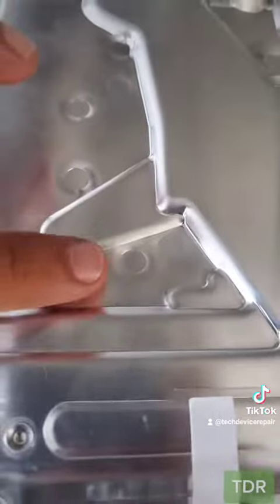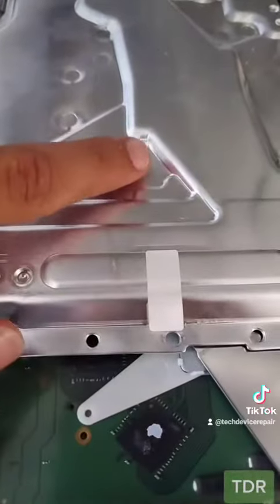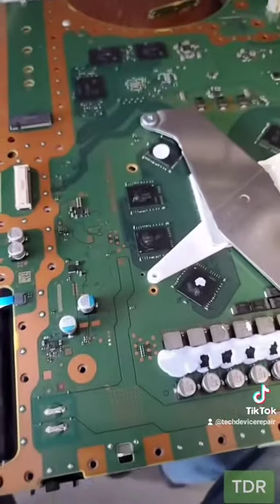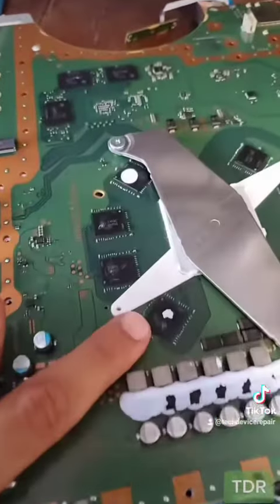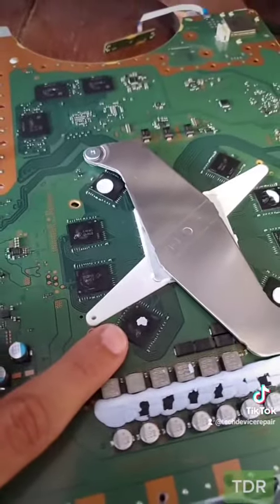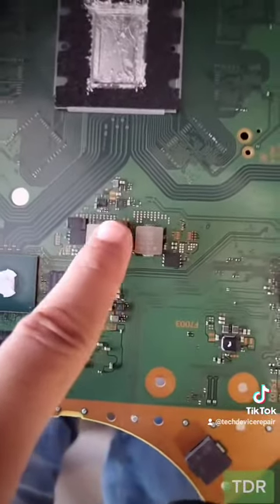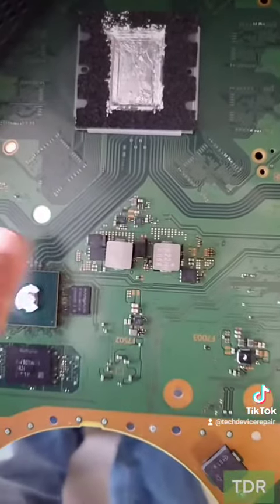Let's check. Yes — I'll be damned. That's the memory chip place for the thermal pad, and that's the misprint right here. Strange — could it be related that when it dropped, the misprint messed up the memory chip? Very highly likely. Another discovery: that area gets hot too. This is the memory power area, and I believe this sends power to the memory that's blown.